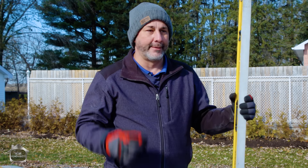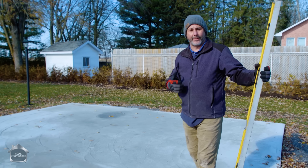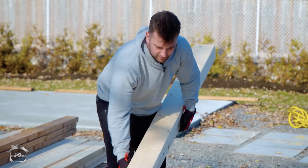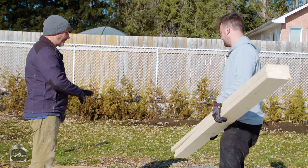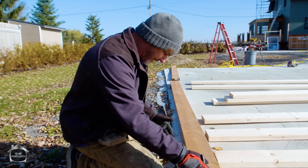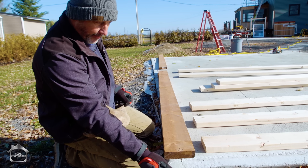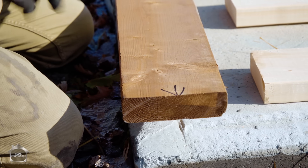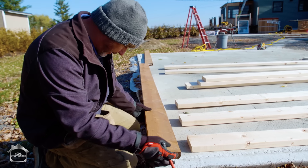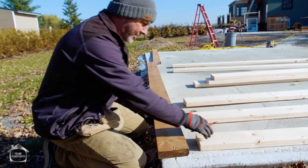We're going to build it in two sections because it is heavy. We'll build one part of that wall and then build the other short wall right next to it right away — that'll keep it from falling over and that is going to be nice and safe. For the layout, I always recommend having the outside of your lumber just a little bit past your concrete. It's really hard to get a perfect pour, and most homeowners are working with a frame that's a little wobbly. So I like to go a little bit past on both sides — like just a quarter inch or a half inch.